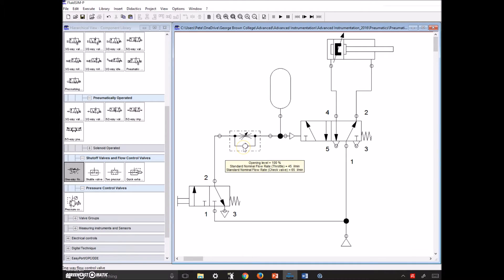This is a one-way flow control valve. We can change this to an off-delay by flipping this component around — it's like a check valve with a flow restrictor built in. Let's hit play and see what happens. In the rest position the cylinder is retracted. Hitting the push button allows air to come up, it seats the ball, and the air has to go through the flow restrictor, which determines how fast the holding tank charges up. That pressure must build up to exceed the spring force, and once it does, the 5-2 changes state and the cylinder extends.